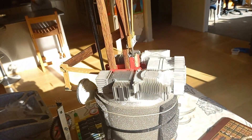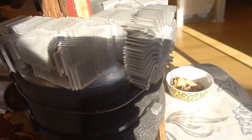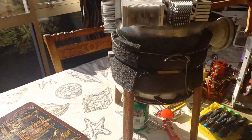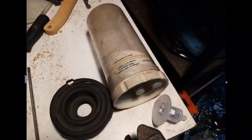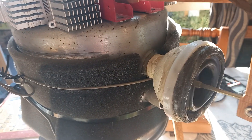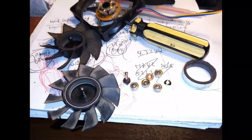There were no plans beyond what was in my head. I looked at all the parts laid out on the floor in the garage and thought — really it all came down to the diaphragm, the power piston diaphragm around here. This diaphragm is the weather seal from behind the headlight of a car, and basically the amount it could go in and out determined the power stroke. It was made with hand tools except for a drill press; computer fans gave me all the little bearings.